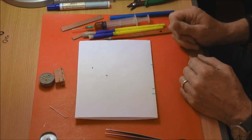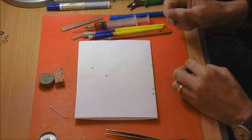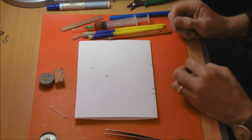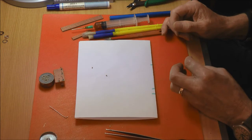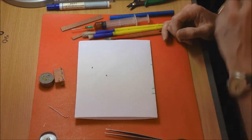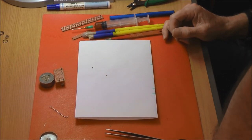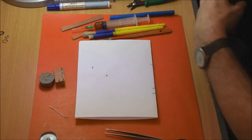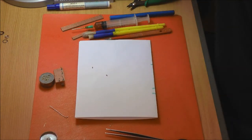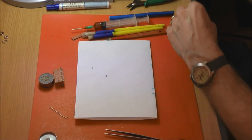You then have pin vise. A long-winded process, isn't it? Yeah. And if you use those boards with multiple holes all over the place, then presumably you make the circuit with mechanical wires between them. Yeah, you've got a series of track strips, so in one direction they're all connected together. So if you've got something on that strip that connects to that one, something that connects that strip to that one, you can just join it with mechanical bond wiring.